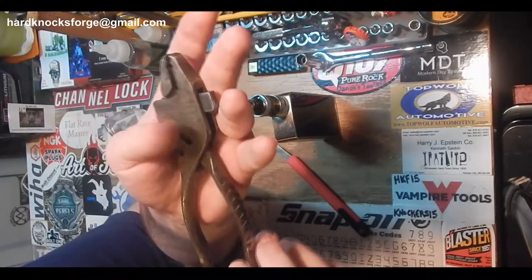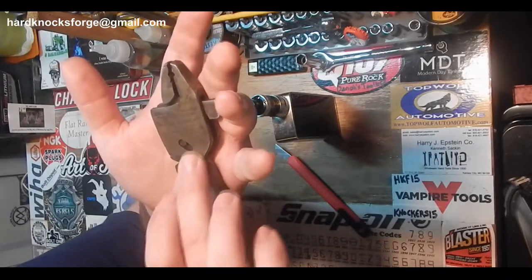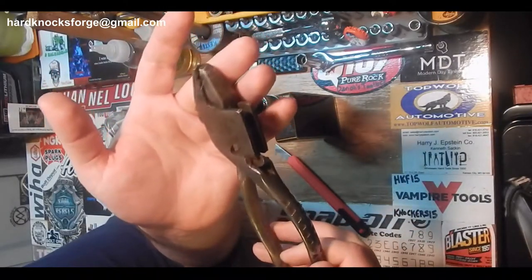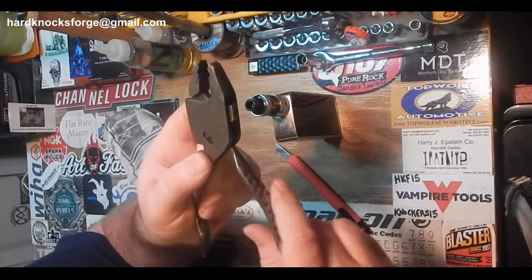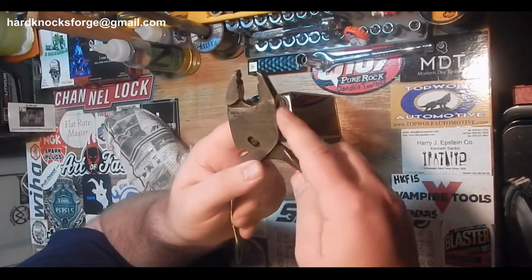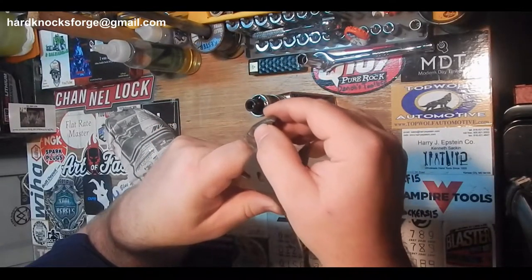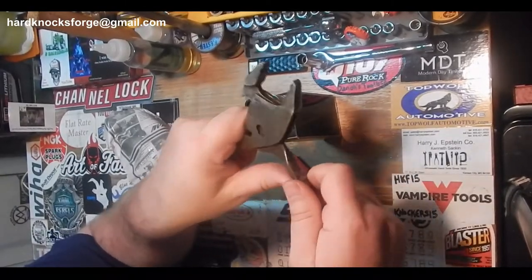Now this one being rare and all is worth quite a bit more, so I'm not gonna go full Scout Crafter on it — I'm just gonna try to clean up some of the crud and keep it in good working order. On these guys, they adjust a little different than the pliers we have today: you have to pull it all the way down, pop it over, and while it's over you can slide it back and forth to get your different nut and bolt sizes.